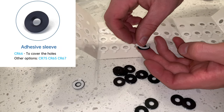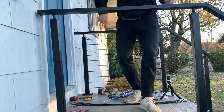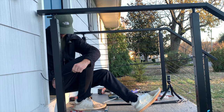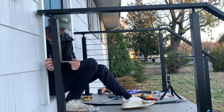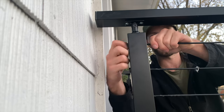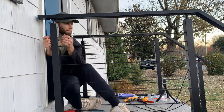Next, take the adhesive backing and put it on each of the washer sleeves. We're going to thread two of these sleeves onto each of the cables — they're going to attach to the post later on. Push your inner terminal into the post and give it a test to make sure it's not going anywhere. Then cut the other side to length and trim off the jacketing as needed. You'll need to do a little trial and error to figure out what length you need so you can tighten everything to your desired tension. On the opposite side of the inner terminal is something called a tensioner, which has a threaded bolt that goes through the opposite end of the post. Tighten that up using the socket wrench. Repeat this for all the cable in your project.